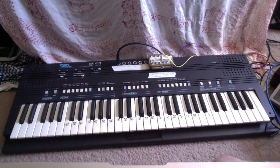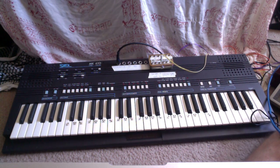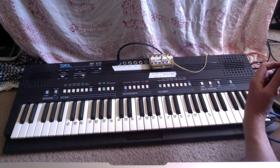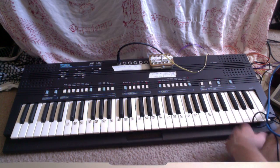So now I'll demo the use of the clock output here to control the Korg drum machine. I've got the Korg coming in - I'm going to pan that to the left. They don't really seem like they're synchronized, but if you have a clock divider or multiplier then you can fairly easily correct it. I believe it's 12 pulses to one - I'm not sure, you'll have to do some experiments - but just to prove that they're synchronized.